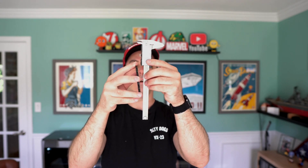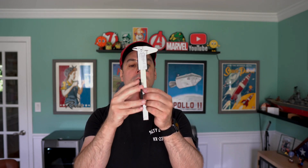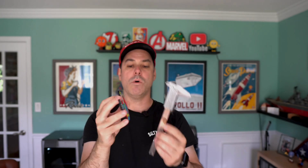There are some slight issues — it did lift adhesion-wise. Something to note and continue to tweak is whether we can add better adhesion. I'm going to try a glue stick to see if that helps get it as flat as possible. Even on the Bambu PEI sheet, if you don't turn off the aux fan, the material cools a little too fast and you get quite a bit of warpage with PLA on the X1 Carbon. Best way to print is aux fan off, top glass piece off the printer, and door open — I find that helps tremendously with getting things flatter.